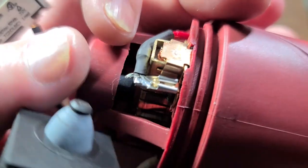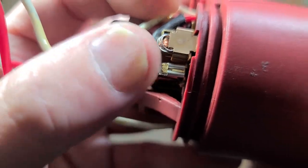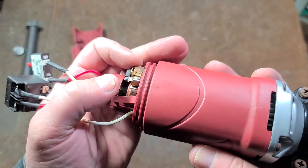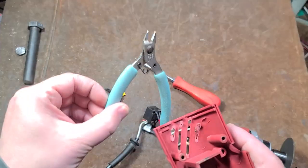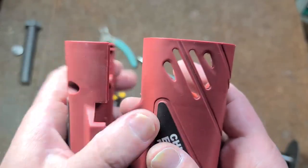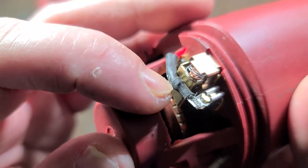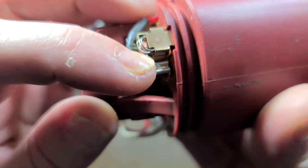This is probably one of the worst parts. We can see these fibers of wire — these wires were not properly staked on here and they've got all these loose strands. So it's not even able to deliver all the amps it possibly could because of that. The only way to really deal with this is to pull these off and add a drop of solder to help them out. I used some simple cutters — it's super soft plastic — and cut out some of those lower fingers on both sides so there's just a little bit more airflow going through the motor. After looking with the magnifying glass, I realized the wire is actually properly crimped — it was just way over-stripped with a bunch of strands sticking out. Really annoying.